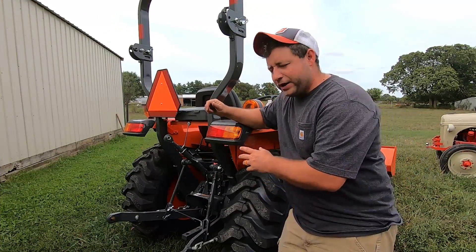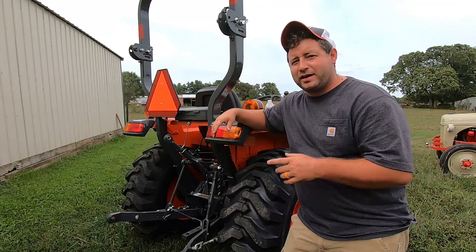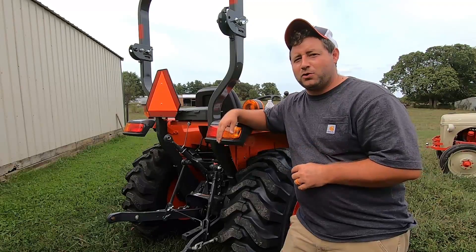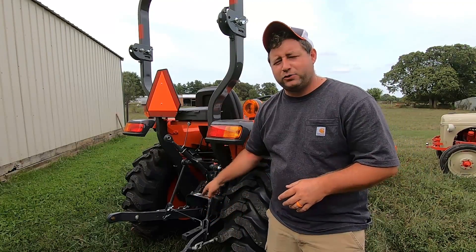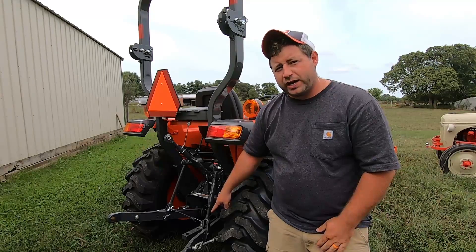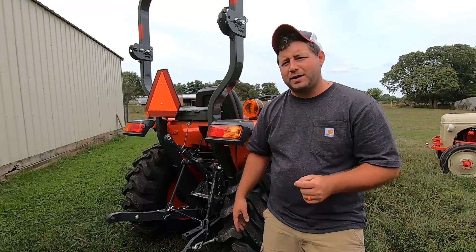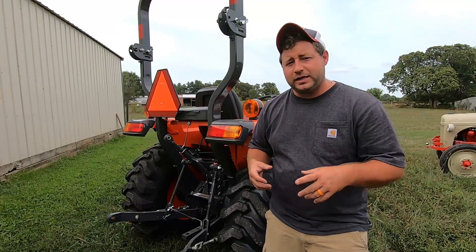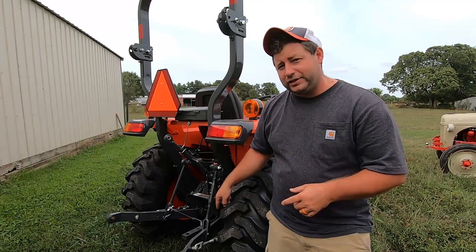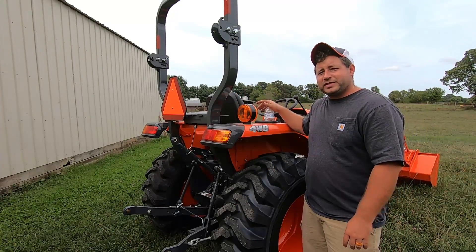Coming to the rear of the tractor, I really like the new technology with the rear three-point system. We have live hydraulics and live power on the PTO, which is very important. We are going to be hooking up a smaller baler to this and running the sickle mower on this thing. This tractor comes standard with the draw bar, the top link, and you can see it has the turnbuckle-style sway controls. We are getting those swapped out — part of the deal was getting the pin-style, because the turnbuckle ones are going to get dirt and grimy and be hard to adjust. We do have the pinned sliding version coming; they're just on back order. Small convenience features like a toolbox on the back and a cup holder on the side are really huge.